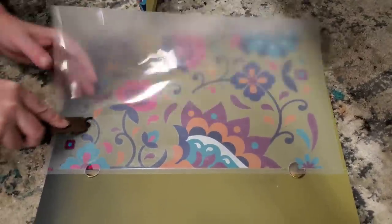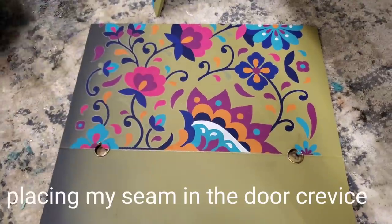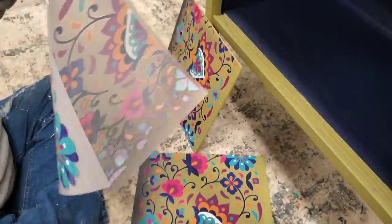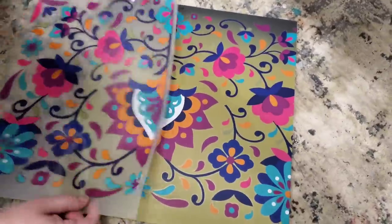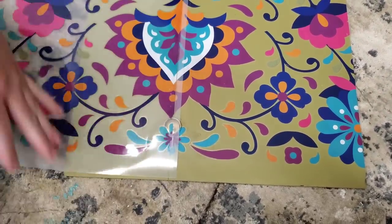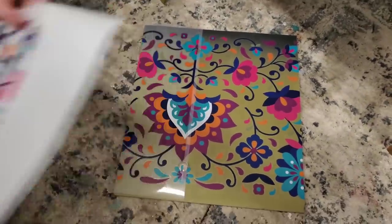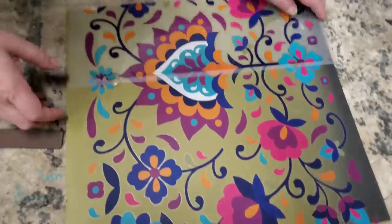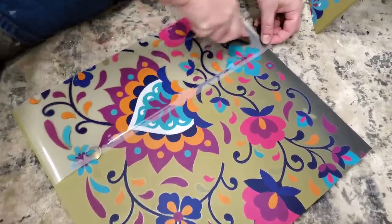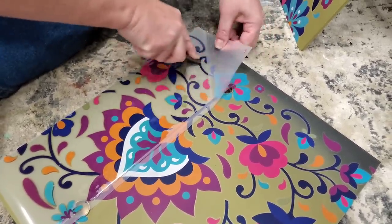With my paint finish complete, I allowed it to fully dry before applying my transfer. You want to make sure your paint is completely dry because a transfer will not take if there's any moisture left in the surface. A few tools I like to have: scissors, the transfer tool that comes with the transfer, a razor knife, and Dixie Belle finishing pads for burnishing. I start by laying the transfer in place, rubbing over it with the transfer stick, and lifting away the backing sheet as I rub.